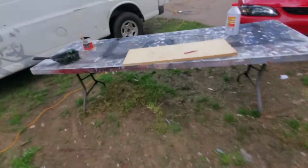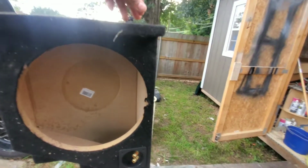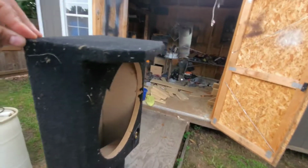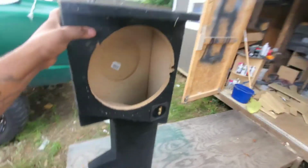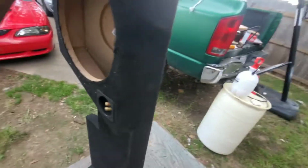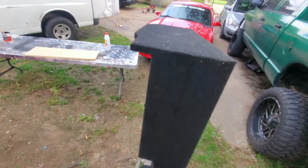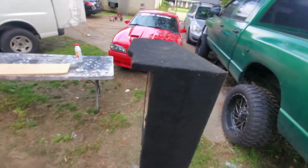What I'm gonna do is take this board here and cut it down to those measurements. Now I'm gonna staple it on here to hold it in place. Now I'm gonna take my router from this corner to this corner and trace all this out, so it'll be the same profile. See how I got a notch and his angle right there. So we're gonna do 2 of those the exact same way. Let me go ahead and get that done real quick, and then we'll go from there.